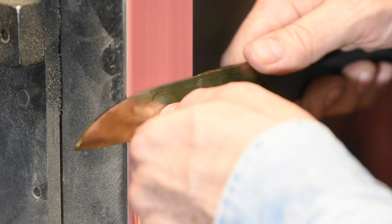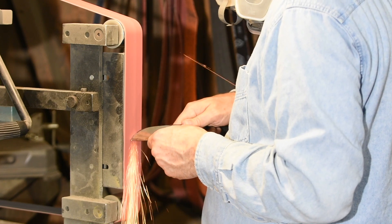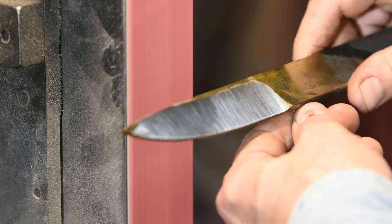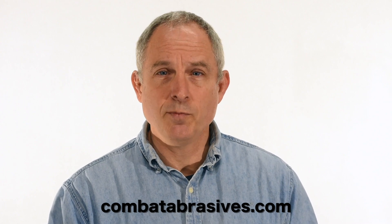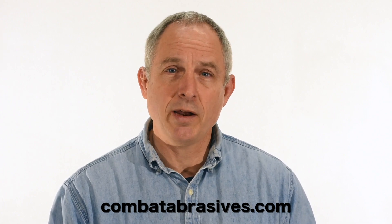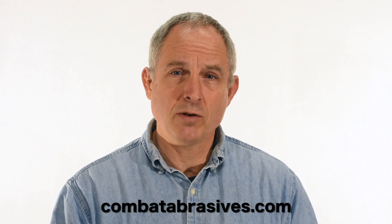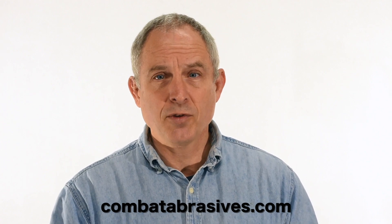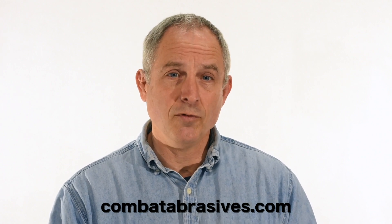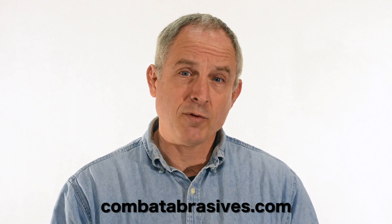I like to start at the ricasso or plunge line, then work my way towards the tip of the knife. I pay close attention to that angle and maintain it, moving smoothly and cleanly out toward the tip. Today's video is sponsored by Combat Abrasives — a family-owned American manufacturer offering a wide selection of belts. I've used many of their belts including ceramic, aluminum oxide, and zirconium. The prices are good and their focus is specifically on the knife-making community. Their basic aluminum oxide belts come in at a good price point and last a lot longer than some of the inexpensive belts I've used in the past. Their ceramic belts for roughing in the 40, 60, and 120 grit range are very competitive with the big manufacturers at about half the price.